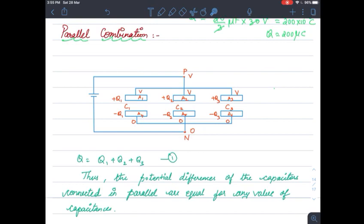The positive terminal of the battery and the capacitor conductors A1, A2, A3 are connected. Since the battery offers positive charge, we have plus Q1, plus Q2, plus Q3 on those plates. At the same time, the negative potential — normally taken as zero potential — means the conductors at the bottom of all three capacitors are all at zero potential. A1, A2, A3 are the areas of the plates which are positively charged, and A4, A5, A6 are the negatively charged conductors.